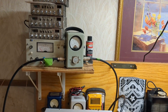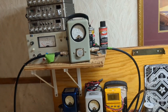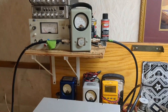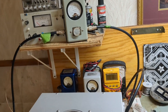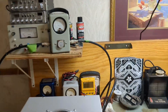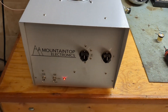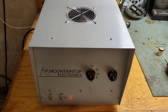I hope this helps answer questions about drive. Between 10 to 12 times your input is what the output is going to be — it's always in that realm, depending on the tube. The 8877 is a much higher gain tube; that's a totally different story. A 35B is different from this. But most triodes are somewhere between 10 and 12 times multiplication. I hope that helps, guys. Mountaintop Electronics — thanks for watching.